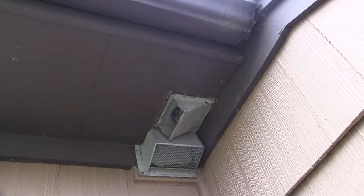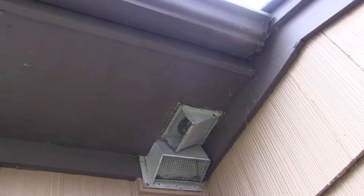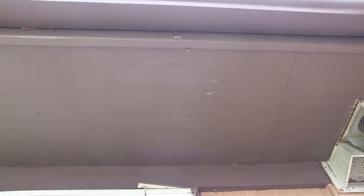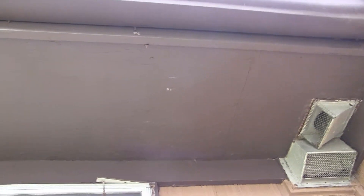This is a big no-no because this should go out through the roof. But if you follow along the soffit, right there is an air intake for the attic. A couple of years ago when I painted the underside of the soffit, in between the vent and that intake right there, all this paint was severely blistered off. I just painted over it and didn't really think to investigate why that was happening.